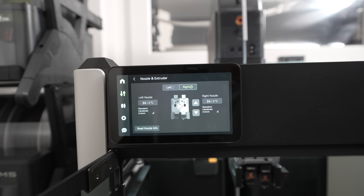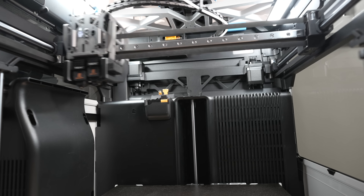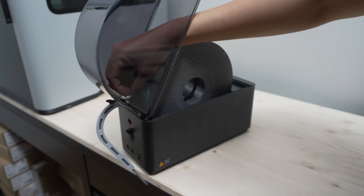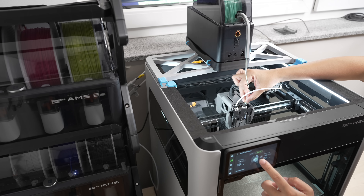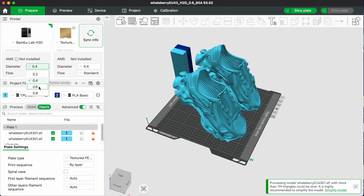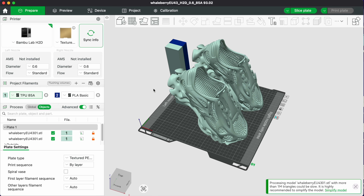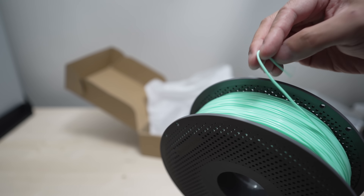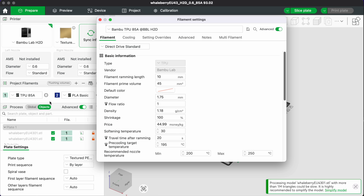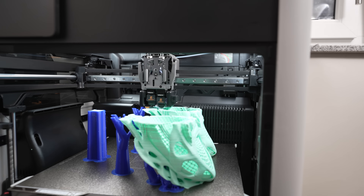Go to the settings menu and tap 'read nozzle info' — it will do some actions and update the hotend size automatically. From here just follow the same steps as previously: drying the filament, placing it in a dry box on the top mount, and loading the filament. Make sure you set the nozzle sizes to the correct one before slicing and sending to print. TPU 85A is a very flexible filament and its default volumetric flow is way less than that of TPU 90A, so it's taking about five days even with the bigger nozzle diameter.